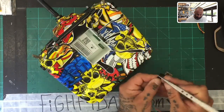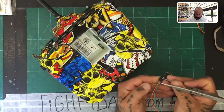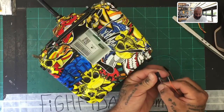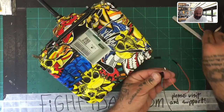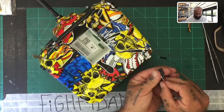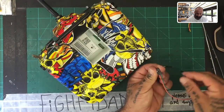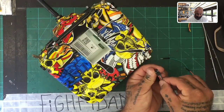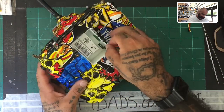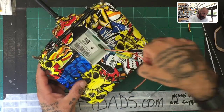If you get the cables from me they're going to be shipped to match properly, not expecting you to make adjustments. But I'm going to swap these two pins right now — I'm lifting those tabs up — just to show you what you can do if you have one cable and want to convert it. We're going to move the positive to the outside where it belongs and put the ground in the middle where it belongs. Now this lines up perfectly and matches the wire diagram.